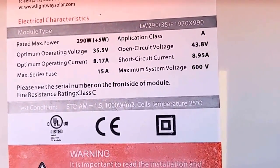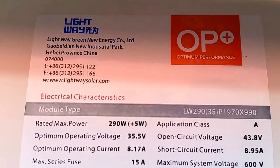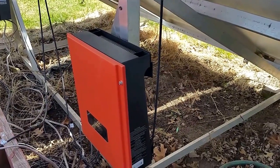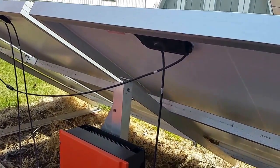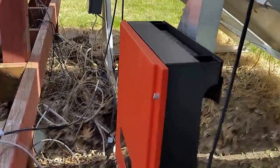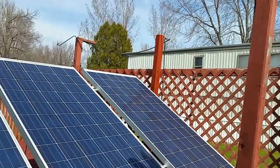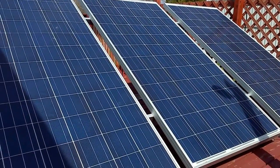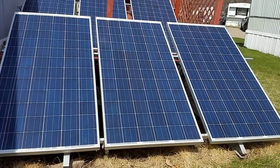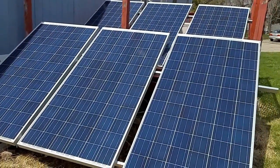The whole system is wired in series — there's no parallel configuration at all because of the controller's string box limitations. Here's how the system is mounted: three panels in the front and a disconnect, all in a series connection for high voltage and high wattage. The panels sit right on his deck, and you can see a security camera system nearby. He used the original mounting kit.